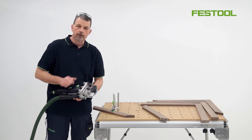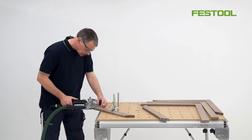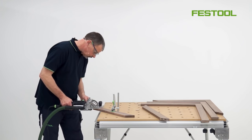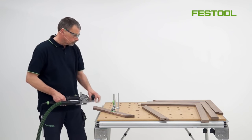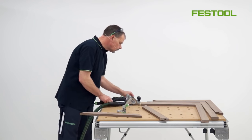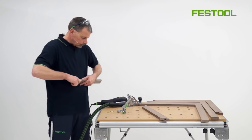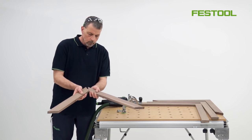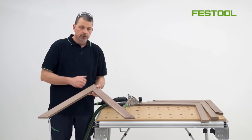We can use the left hand side of the main machine to reproduce the two cuts. Then we can insert the two dominoes and bring the two pieces of timber together, and again we end up with a joint which is flush on the surface.